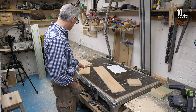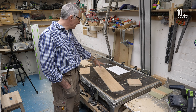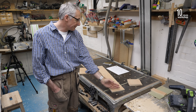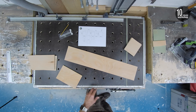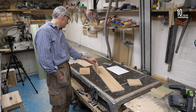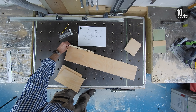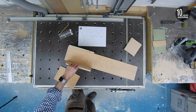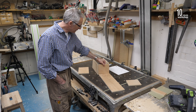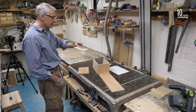Basically what we've got is the tall back - I've made the back taller because this is going on a fence and I want the bird box part to be up at a level in my next door neighbour's apple tree, which gives me about 250mm (10 inches) to pop a couple of screws into a fence post. I've also made the bird box slightly taller to accommodate the camera. We've got two sides with an angle on them, a bevel on the top of the back, a base with some drainage holes in it, and a little shelf up there with a hole in it for the camera.